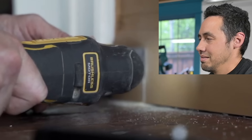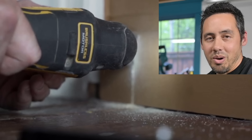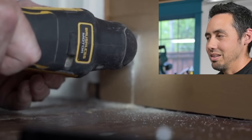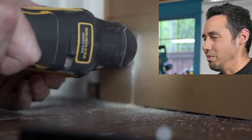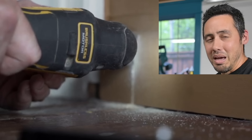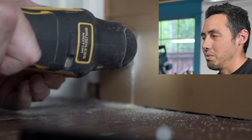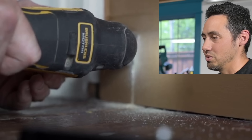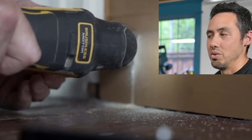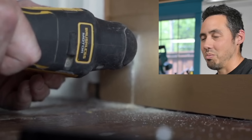The video says to locate areas where base molding meets door casing or ends at a solid surface — that's where you'll start. Problem number one: why are you bringing out the oscillating tool? I would much rather just pop that base off. The oscillating tool is annoying, loud, throws dust, it's hard to make straight cuts because it wobbles around. To have a seam join together using an oscillating tool is not something I would prefer. It's so much easier to tear the base out — it's not a fine precision cutting tool.